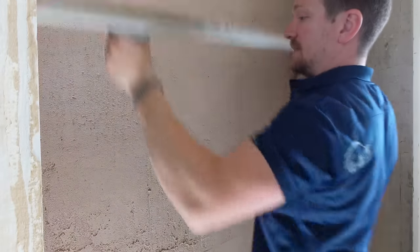Here's a great test to see if it's too soon — if you can literally put your fingers into the wall and leave an indentation, you've got to leave it a bit longer. The next stage involves a sponge float. This is what we're going to use to give the plaster a bit of a key — we need to get rid of the bumps, the lines, the grooves.